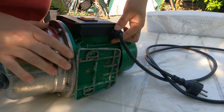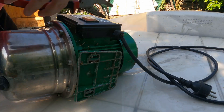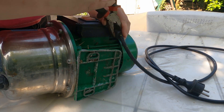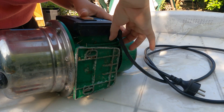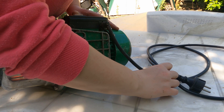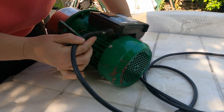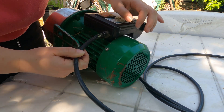The first thing I wanted to do was just to check all of the pump. We actually noticed that the cable isn't looking that well, so I went and first removed the cap. The cap is a rubber cap, but it's really screwed on well. When I removed the cap I could really see the damage — two out of three wires were snipped off at where the cable was exiting the electrical part of the pump, and so the pump wasn't working because of the issue with the cable.